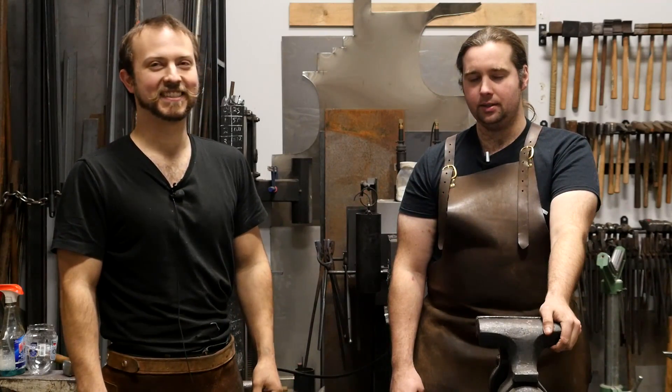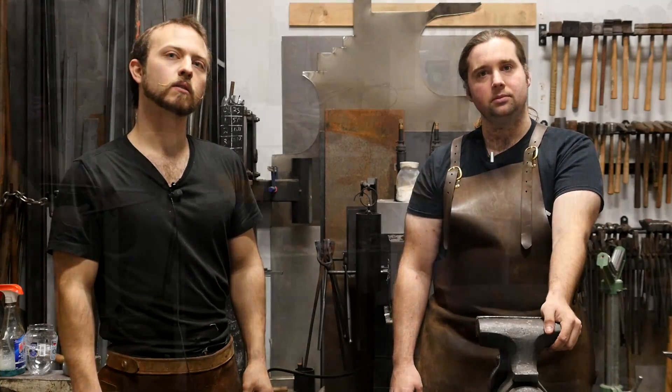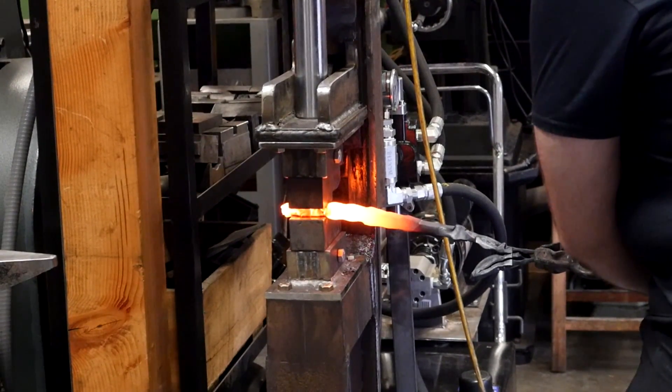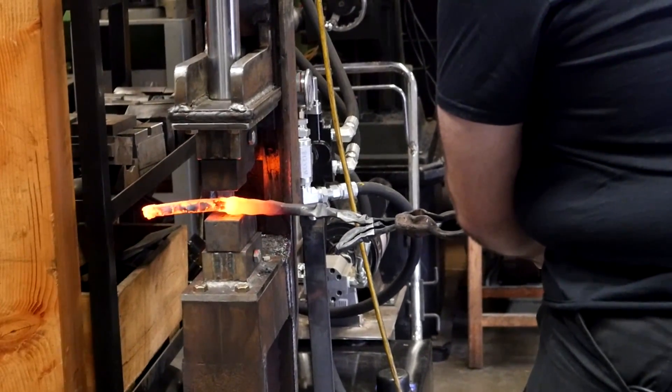But you've got to have them all though. Can you summarize in fairly simple terms how the different layers of steel actually bond? What you do is bring the metal up to a high enough temperature that the atoms are actually willing to move more freely, and you create complete molecular diffusion by applying the right amount of force with the right amount of temperature — not completely molten like a liquid as if you were casting, but past where we're still forging it, where it's kind of like a hard clay. There's this middle ground where the material can be coerced together by force or by impact, and the molecules will join. That's what gives us our pattern welding, but it's all in how you get there.